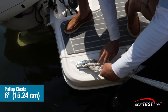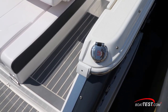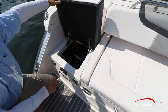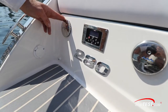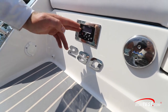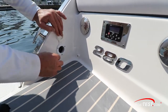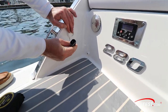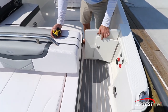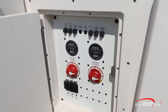Off to either side are both a six-inch pull-up mounted cleat. The boat's fuel fills are just above and to either side of the fixed cleats. The starboard side seating reveals convenient battery and holding tank access. Just below that is a pump-out port, Clarion audio controls, and water fill. A retractable battery charging cord is mounted to port. A partition door divides the cockpit and swim platform areas, and the 280's main breaker panel is located on the starboard side behind that door and contains the main house and engine battery shutoffs.